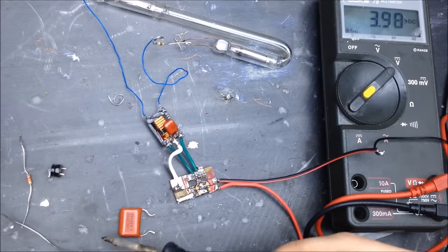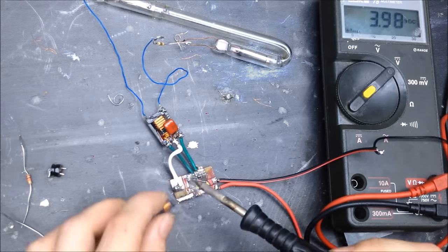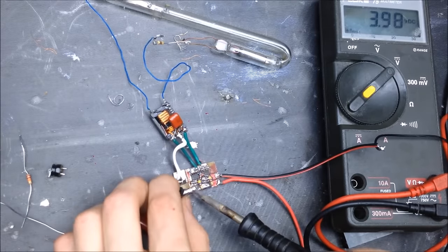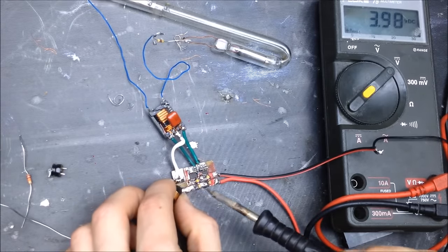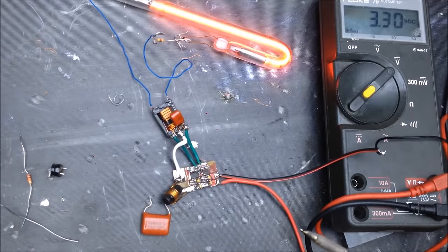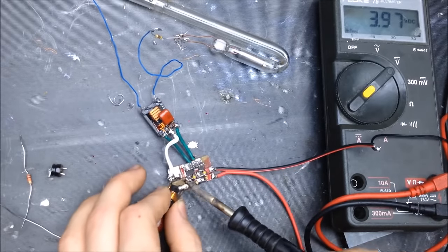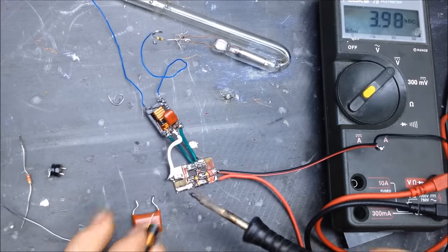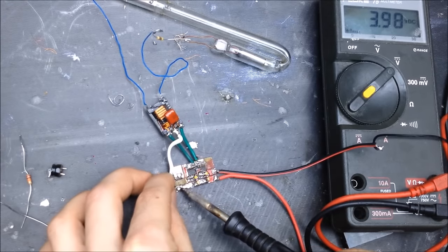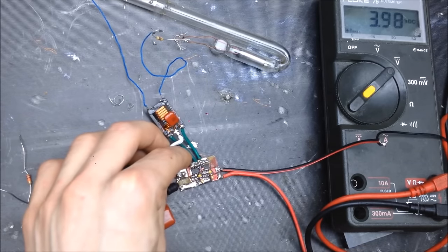Let's try a heavier inductor. Maybe that'll kick off and draw a bit more current. We can see that current go up as a voltage drop with some output. But it went right to 3 volts, so right there. Not working. Very, very inefficient. Probably a solid latch state right there. 3.2, so with a heavier one, much more current draw. I think I'm going to go with that little guy for now, see what happens. So this inductor is probably not rated to take the power, but it gave us really good results.